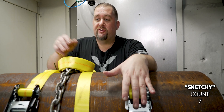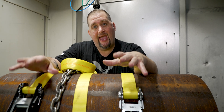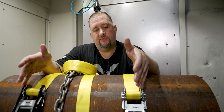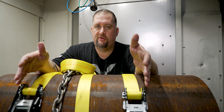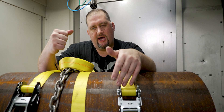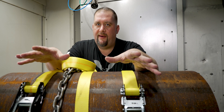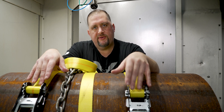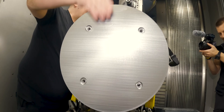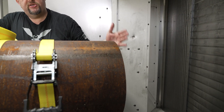Take a look at this super sketchy setup. I'm not saying anybody on the planet should ever fixture a part like this, but our only options were to either make some saddle clamps — which would have been super time consuming — or get chains with ratchets on them. We had to get this done in a hurry and all we had to do was some super lightweight operations. Between this chain and these two ratchet straps, we also had 2,200 pounds of material pushing straight down onto our table. On this side of the part we put our four pull stud holes in, and on this side we put two eye bolt holes.